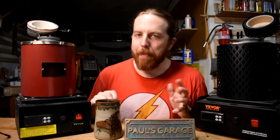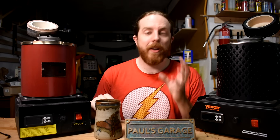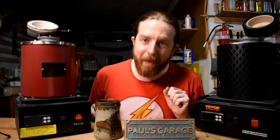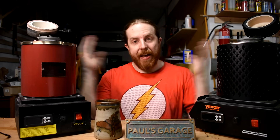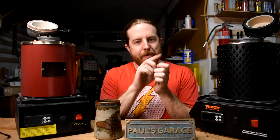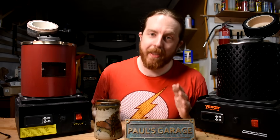A steam explosion didn't blow this thing up — it was already melting bronze, up to glowing hot with the bronze turning liquid, so all the water would have been long gone. But when it was heating up, if there was water in there and it boiled faster than it could off-gas through the graphite, it can cause little fractures, little cracks or pops in the surface. So how can I — and by extension you — prevent this problem in the future?